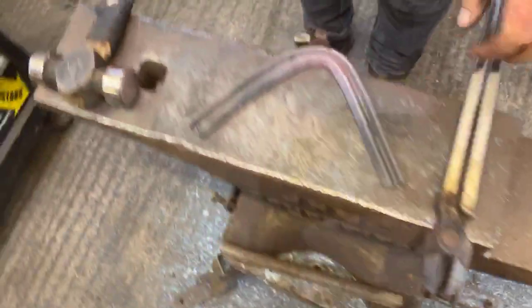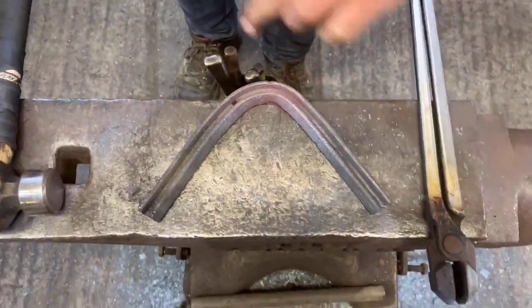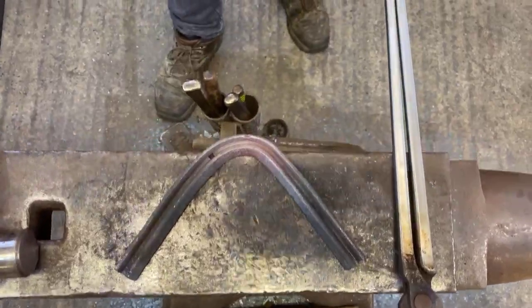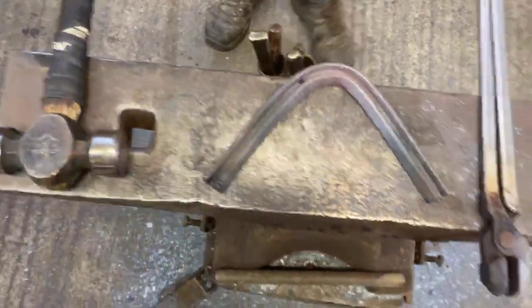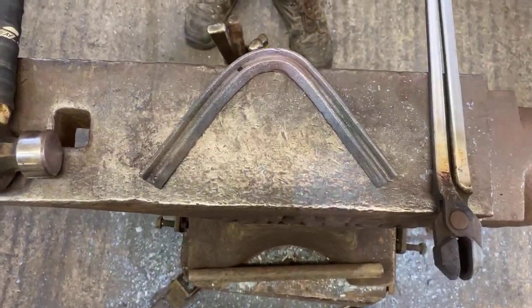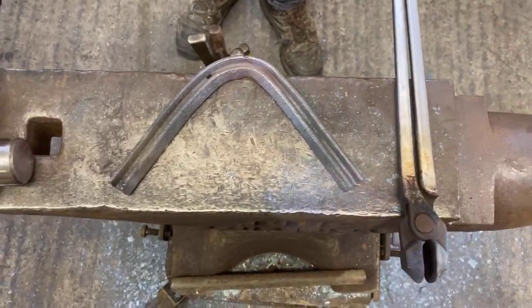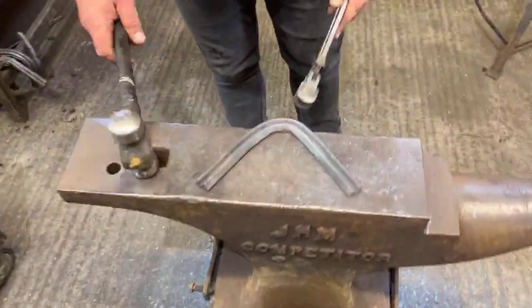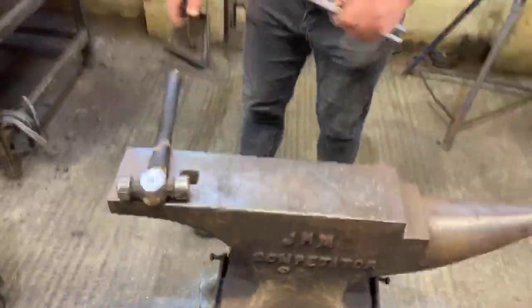Now, we'll see how straight it is from that toe. One of the important things when we make these irregular shoes, be it anti-brushing shoes, side-bone shoes, etc., is that it's very important that the normal side we make first. So for the side-bone shoe, the medial branch is the normal branch, so I'll always turn the medial branch first in that case. We normally do the outside branch first, the irregular branch on the inside. So we just make the rest of the shoe as normal first, okay?